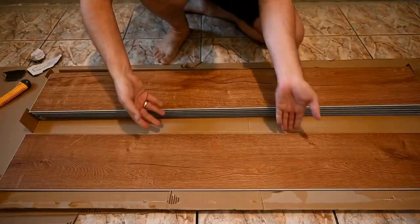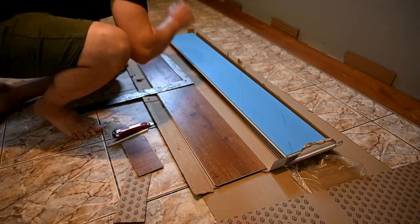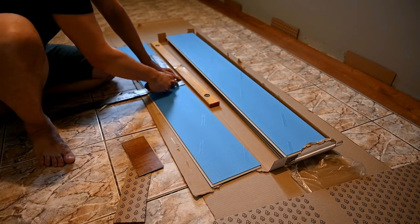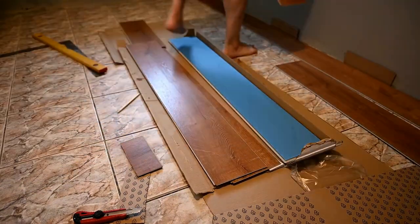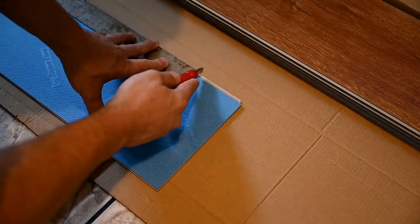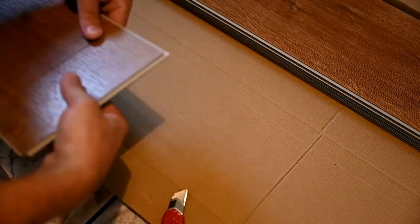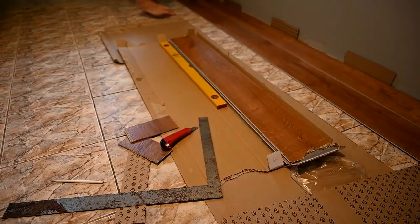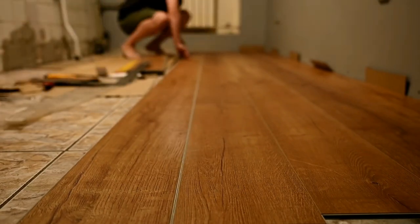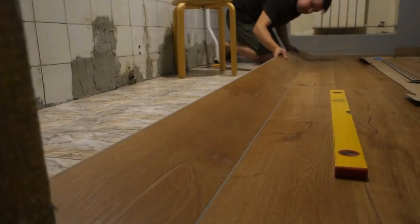Then on to the floors. We wanted to change the floors very much since we didn't like the old tile, but removing it would be too hard, so we decided to cover it with floor planks. They are made of a waterproof material — a mixture of quartz and vinyl. They look just like ordinary laminated floors but they're waterproof, which is great for a kitchen. These floors are quite easy to assemble: you can cut them with a box knife, break a plank along the pre-cut line, and all the planks fit into each other. My husband had never done this before and finished the floors in an evening. They are also rental-friendly because you can disassemble the floor just as quickly.